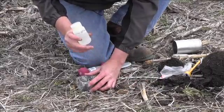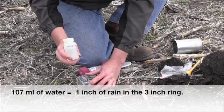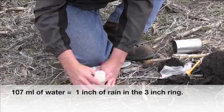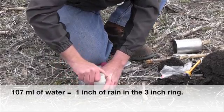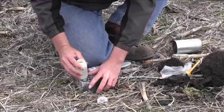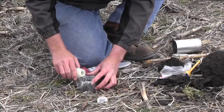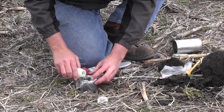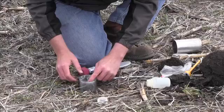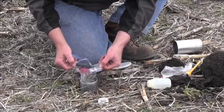In the cylinder, you take that jug of water filled to 107 milliliters, which represents a 1 inch rain in a 3 inch cylinder. You pour that water into the cylinder. Hold the saran wrap the best you can to not let any water through until you start your time. Once you have all the water in the ring, you pull the saran wrap away and start your time.